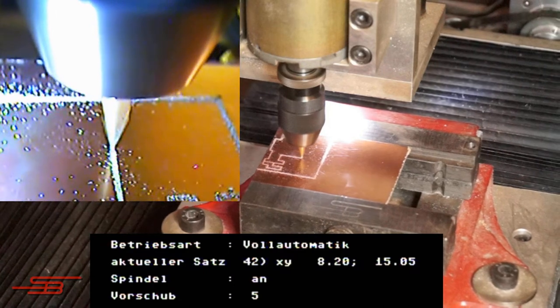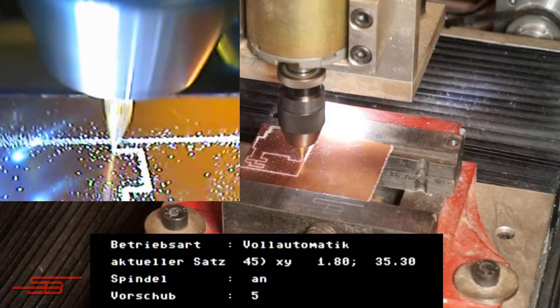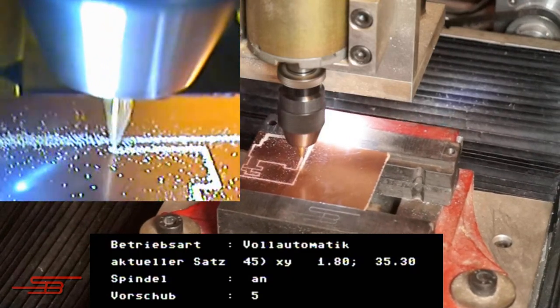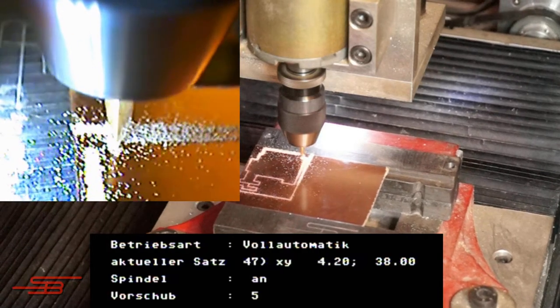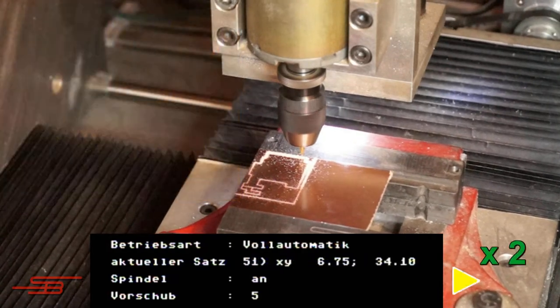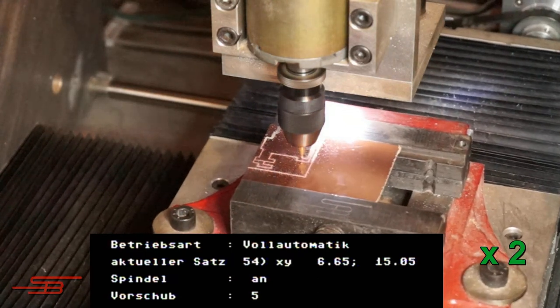The finished engraved and drilled PCB is equipped with a 7805 voltage regulator, an ATtiny85, an A4988 stepper motor driver and some resistors. This board can then be used to control a stepper motor via the Tiny85 software.